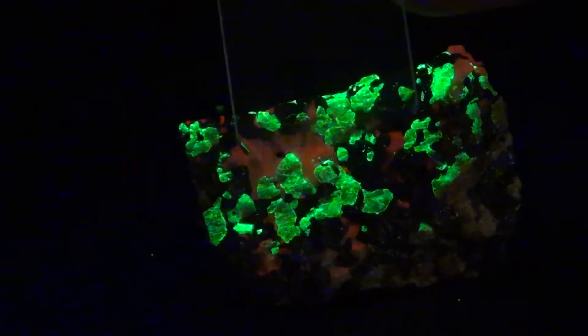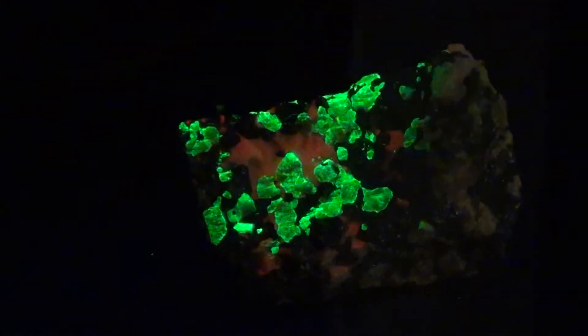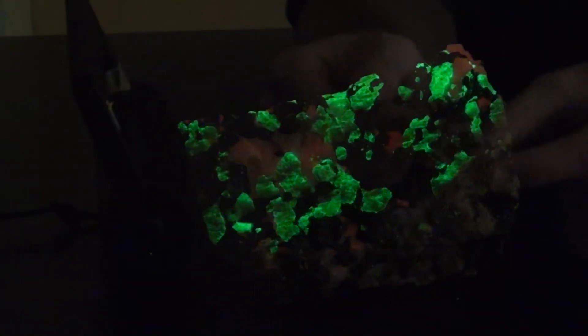Here's a surprise: here's another piece of glass which looks essentially the same as a microscope slide, except watch this — it does not block the ultraviolet light. How is this possible? This piece of glass is made of pure quartz, so-called quartz glass. It is made of only silicon and oxygen, whereas regular glass like this microscope slide contains calcium oxides, which are impurities that help the glass melt easier. Essentially all regular glass is made that way, except for specific applications.